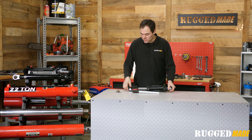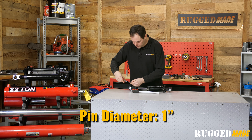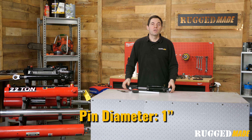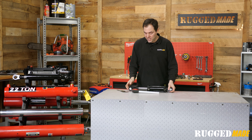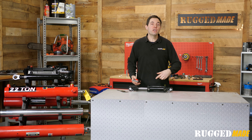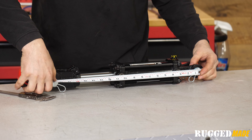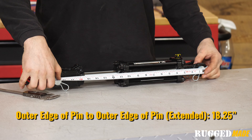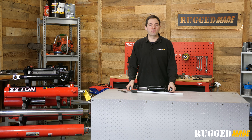These are one inch pins. If you're having a little trouble getting a measurement to the dead center, or if the pins aren't there to the dead center of the hole, it's pretty easy to just go to the outer edge of the pins. You just want to be on the same side for both. So going from the outer edge of one pin to the outer edge of the other, we get eighteen and a quarter inches extended and fourteen and a quarter retracted. We'd still get our four inch stroke.